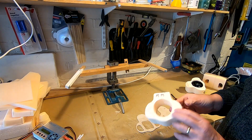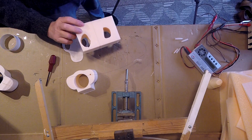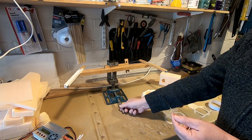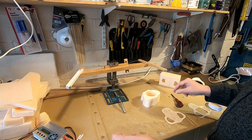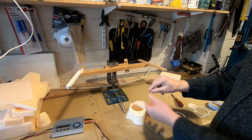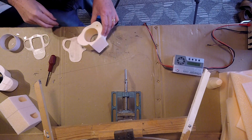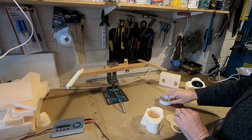So we'll go on to try and get these jet tubes cut out. I've already done a couple of tests on some scrap pieces just to see if it works okay, and it seems to work reasonably well. What we're going to use for this is a bow, and you can see I've got it mounted up in a couple of vices here. So what we're going to do is pass the wire through the hole in there with the templates on there. We'll switch the hot wire on once we've got it tensioned up and then run it around the templates. First thing we'll do is get some double-sided tape on - I've already tried it once but this tape's gone a little bit dry now so we'll put some more on and give it another go.